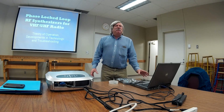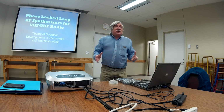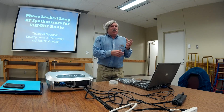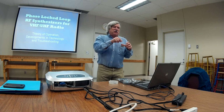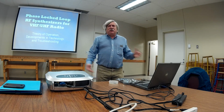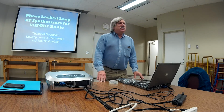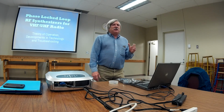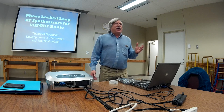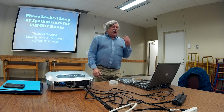But wow, I'm thinking back to a time long ago in a land far away. I was at the radio club and my friend Mike had a 2-meter HT made by Standard, and it had a click rotary switch for a channel selector, A, B, C, and it needed a crystal for the transmit frequency, a crystal for the receive frequency. And whoa, we don't really have anything like that today, do we? Because our 2-meter HTs have got phase lock loop synthesizers giving us hundreds of memory channels, priority scan, band scan, all these wonderful things that we just couldn't get with crystals.